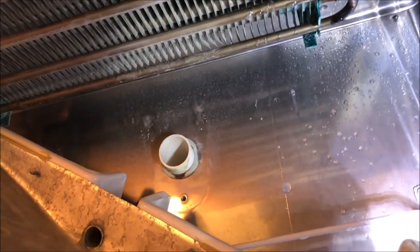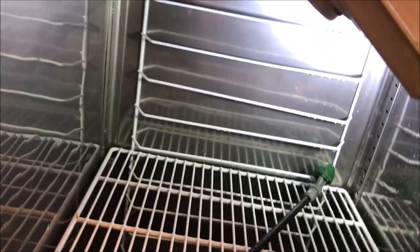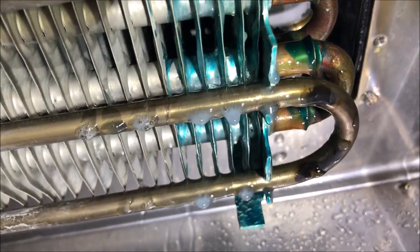Now let's see if we can see it with bubble soap. Sometimes when it's up in this section it's really hard to see a leak - when they're on the sides or U-bends the soap will catch it easily. It'd be nice to get a picture to save on the work order for the customer, but we have the video from the leak detector confirming it.